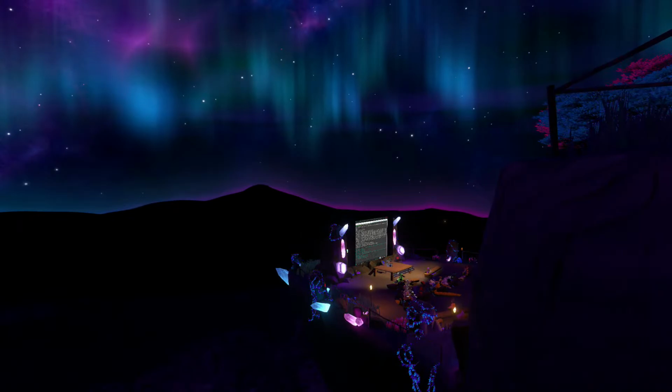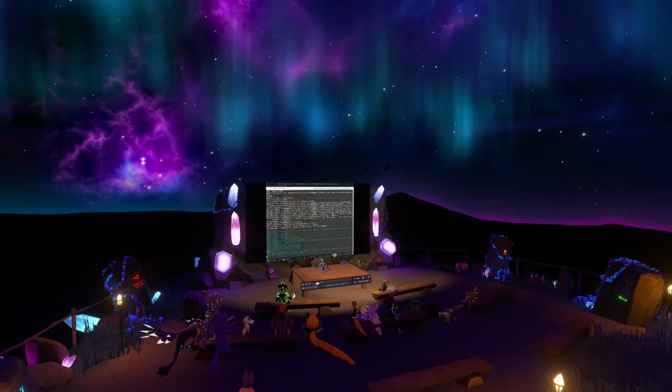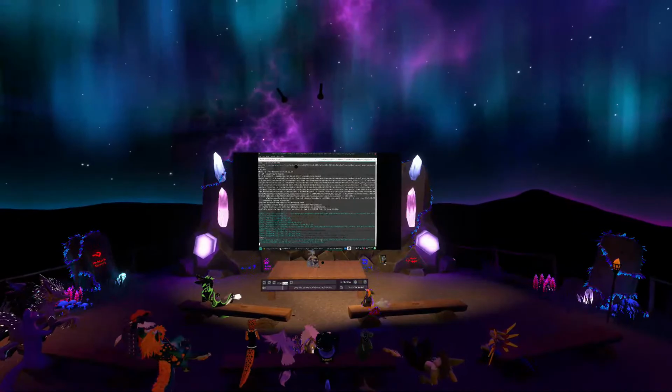Okay. So it's on step one right now, which is running the synthesis, taking the Verilog and turning it into a standard cell netlist. This is going to take just a minute. It could be worse. I've had this step take up to 2 hours before as well. It's not multi-threaded either, which doesn't help. There we go. It's already doing some timing analysis. Floor planning.